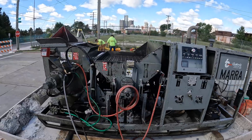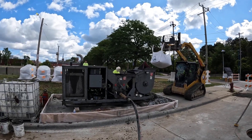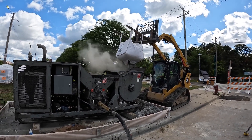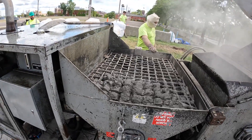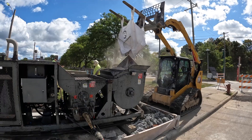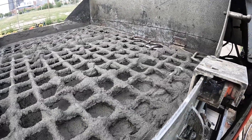These guys have already pressure washed the pipe and prepped it and got it ready for the cement liner. You bring this big sack of powder and drop it on that mixer — see that little triangle? It pokes a hole in the bag and all the powder falls in. You just add water and mix it up. That right there is the pump, and you mix the powder in that mixer.